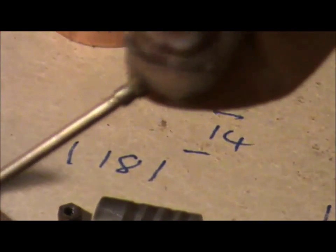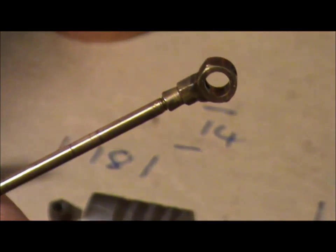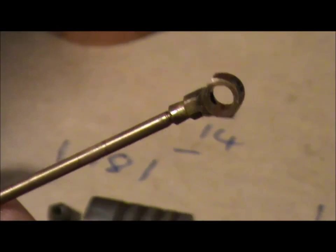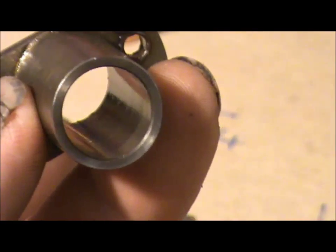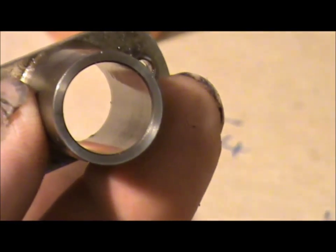They've put grooves in the piston, which is quite easy to make, to attach the rod to the bottom. On the end it's adjustable - excuse the monkey thumb - that's to get the right height of the piston, because it has to be about a millimetre off the bottom. You can adjust it up and down to get the piston at the optimum distance. Inside there you can see a lovely smooth bore - I think it's been honed. This is steel; some people use brass, and there's nothing wrong with that. I think I'd use brass - it's easier to machine.